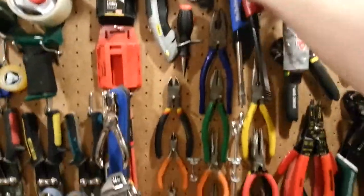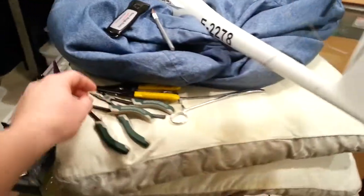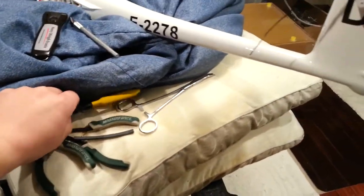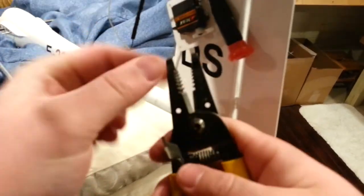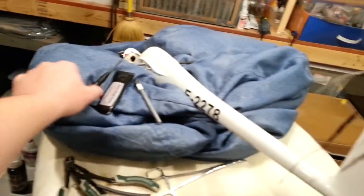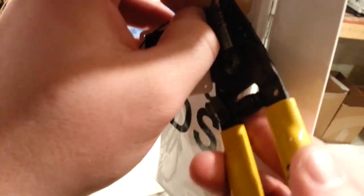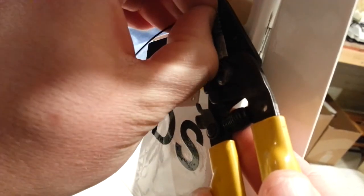So now our next step is to penetrate that wire, and this is a little bit tricky because we don't probably have enough room to get our stripper head through there. See, we've got to be able to get half of this through to make the cut. We're going to try, and we're probably going to fail miserably. I'm pretty much planning on it. Oh, look at that. We're lucky enough to get through. Okay, so then we're just going to cut and then pull gently away from the servo. We're going to damage something. I'd rather damage the wire. We can always fix the wire, worst case scenario.